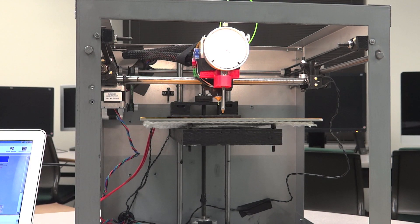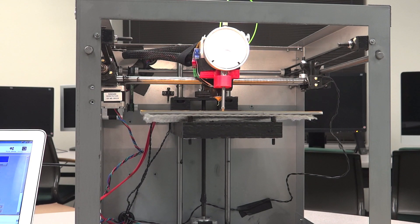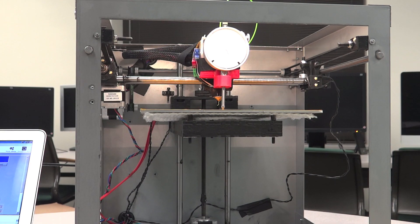Nonetheless, I've attached a dial indicator, and the indicator is about 3 centimeters in front of the printhead, so I'm not going to be able to reach the far back of the build platform for readings. I'll try to go as far back as possible. I'm going to lower the print bed 10 millimeters until it starts reading, and at least for the center, I'm reading about 94 — that's in thousandths of an inch.